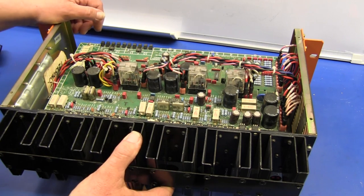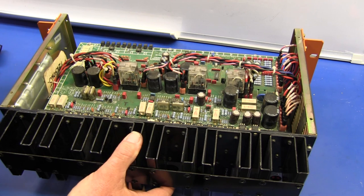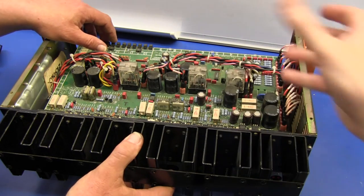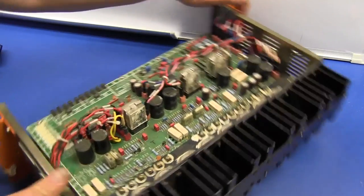Yep. And so that would be a swept sine test? Yes, through that range, just continuous sweeping, once every 10 seconds or something. Yes. And there was an additional pre-test where they actually went through searching for resonances that were visible to the naked eye. Was it only tested in one axis, the axis it was mounted on, or was it tested in all three axes? Seriously, I can't remember. It was 20 years ago.